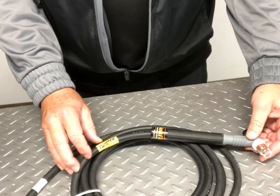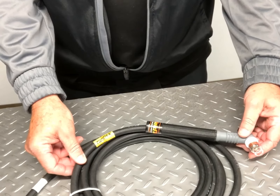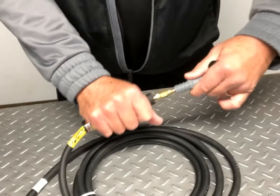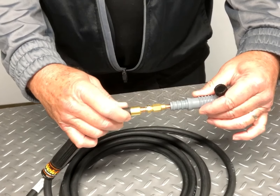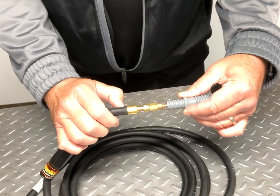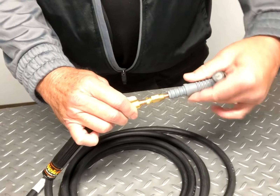The Twister power cable is simply a standard 150 amp power cable for a Model 9 or 17 with one big difference. As we pull the handle back, it looks like a standard connection — the three-eighths male connection — with one big difference: we use a different color-coded ferrule, in this case brass, to determine that the torch end now has that same patented swivel end.